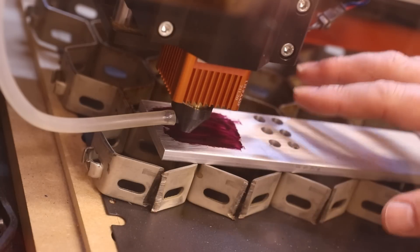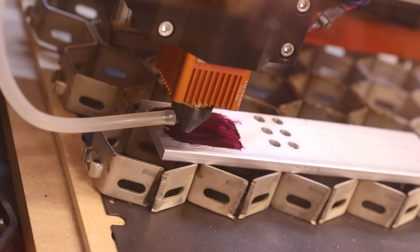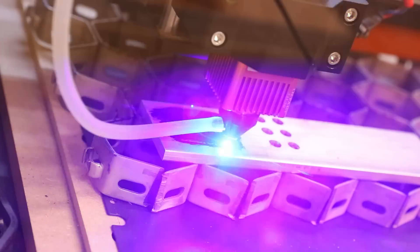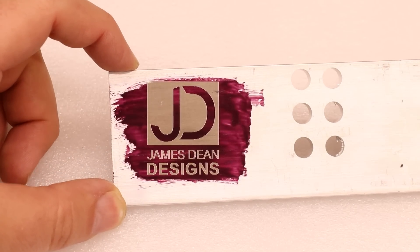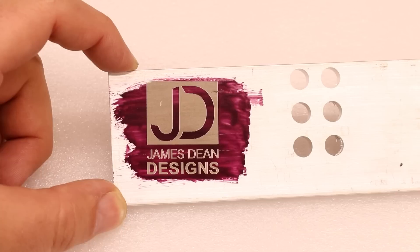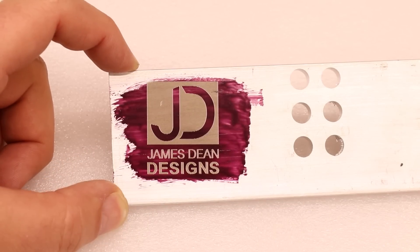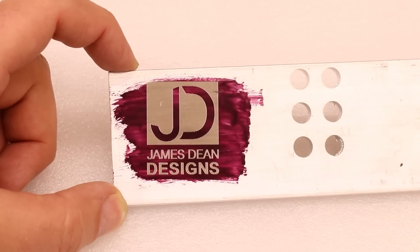Every time I test a new laser, I like to try a new technique. What we have here is a piece of aluminium with purple nail polish painted on it. The hope is to try and engrave some of that colour into the metal. We're going to run this at 100% power at 1500 millimeters per minute. So this is the aluminium piece after it has been lasered. As much as I love the look of this and the rough edges and the finishing on the paint, I suspect that once I start to clean this up, all of the paint will actually come off the aluminium.